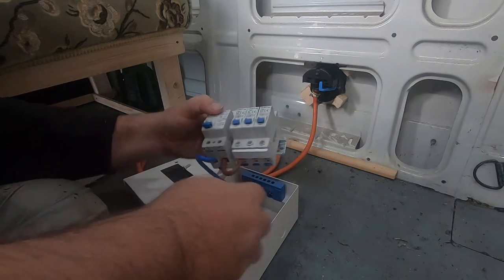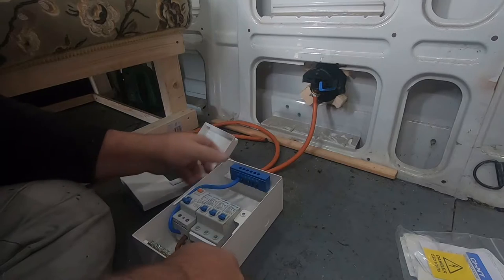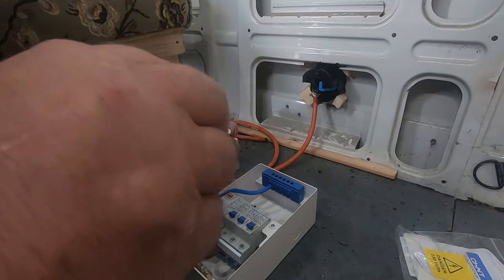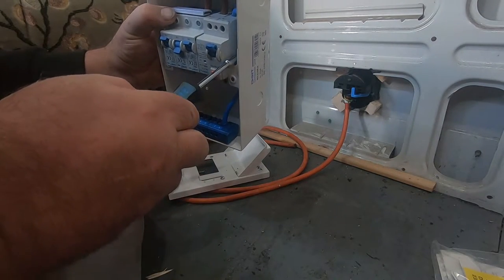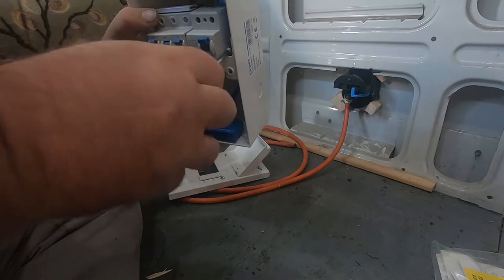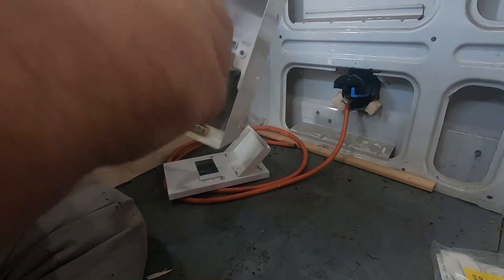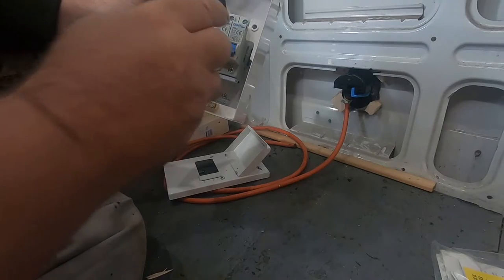All your lives — simple as that. Get the stickers out and put it back. Fasten that up. You've now got three. Put the screws back in. There we go — all three screw together nice and tight. 16 amp, 6 amp, 16 amp — all the earths, all the neutrals, all the lives.